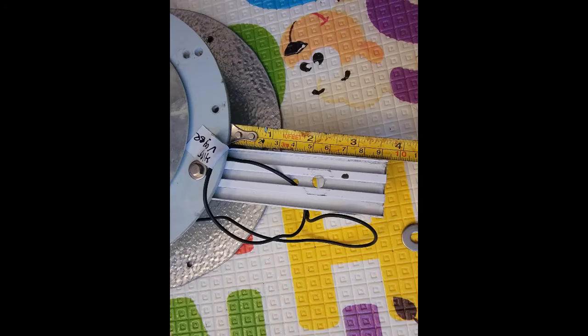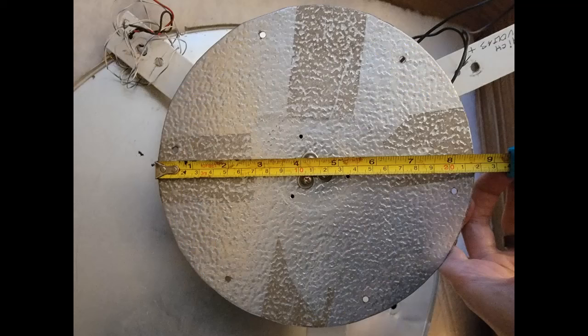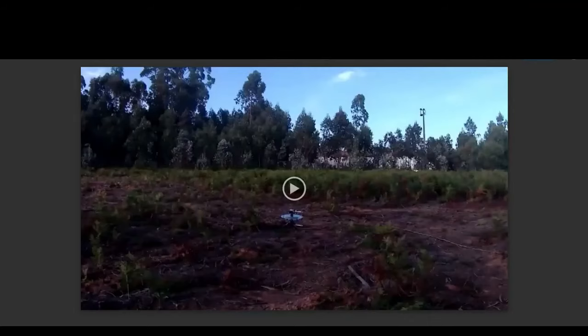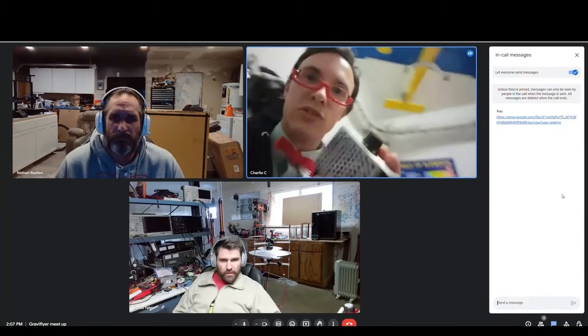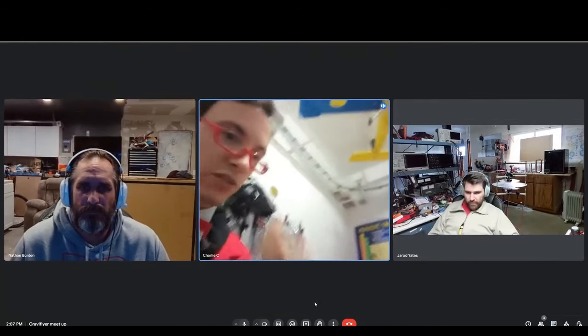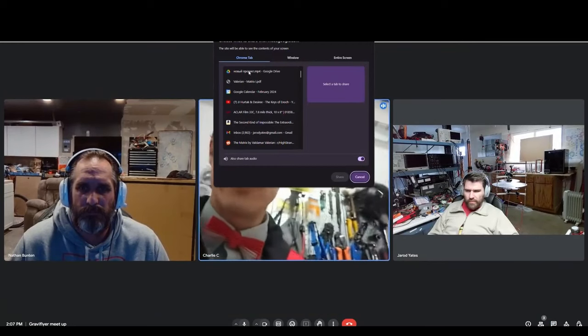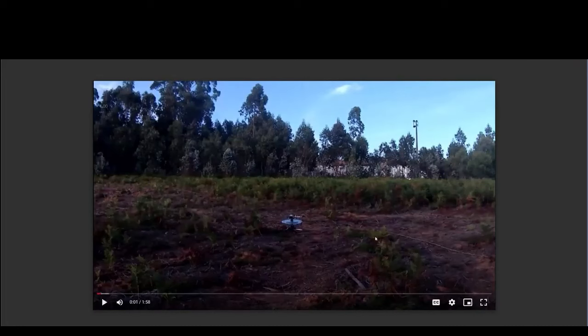I have that outdoor video. I have enough amperage safely to control it. He's used a smaller PWM than in his kits — the little ones on Amazon — but these sometimes overheat. The larger one works better for both the motors and the high-voltage DC. He slowly ramps up the high-voltage DC and doesn't turn it on full blast right away, which a lot of people don't know. Those are tuning instructions he hasn't made public yet.